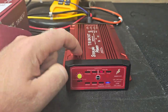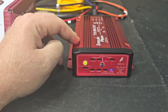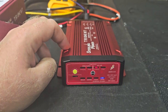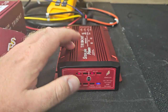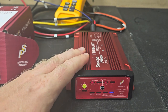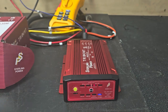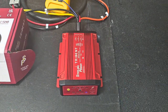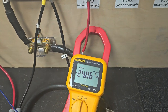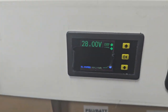The final thing to mention is because this does 12 and 24 volt in, this can be installed on a 24 volt starter alternator system. The solar and the DC-DC input uses the same circuit, so it will work either on a 12 volt input battery or a 24 volt input battery. I can demonstrate that now — that's the input voltage at 14.03 volts. If I just double that to 28 volts — current is still 24.8 amps and now the input voltage is way up at 28 volts.